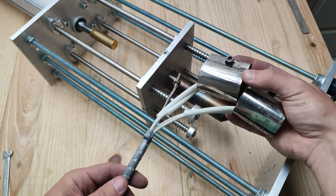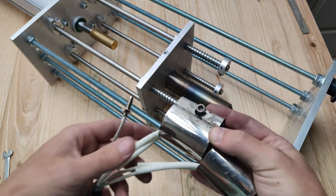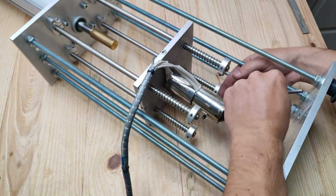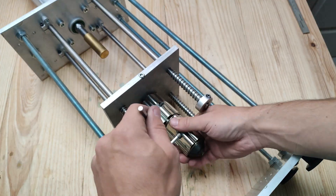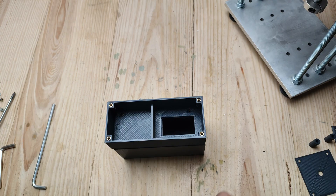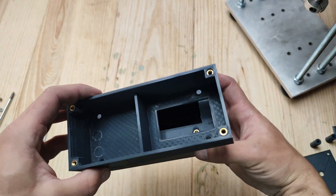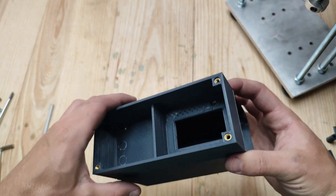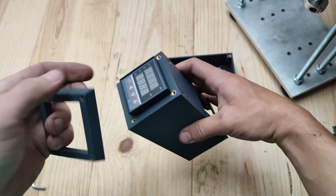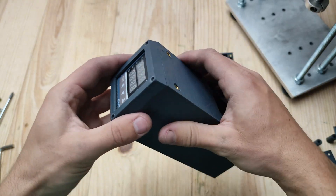Now the two heat bands with the PID controller temperature sensor that I joined inside this cable housing. For the 3D printed box I use brass inserts. The box stacks nicely. There are holes to pass cables. Everything is made so that cable management is as easy as possible. In the project file I'll give you the wiring diagram. I will not film the whole cable assembly because it takes long and it's a bit difficult with the camera to take every angle.